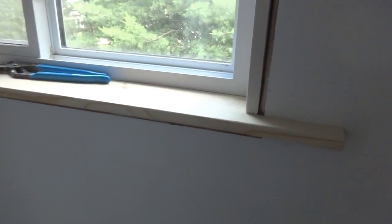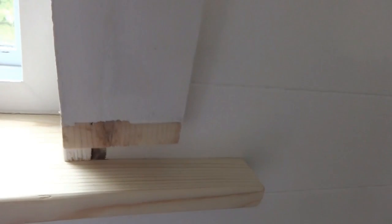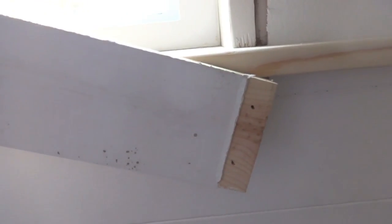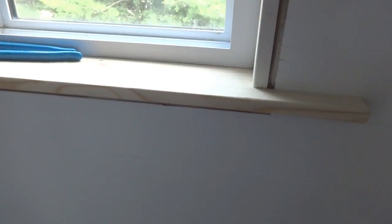Here's a better idea of how I'm doing the window trim. The sill goes all the way back, comes out an inch and a half, and extends to the sides so I can cut another piece to cover the inner board and overhang a little bit. Same thing on the other side. The board up top is wedged in, and then I cut the top piece with that little cut-out. Down at the bottom I have a big one - probably a one-by-six - with the slight angle cut on it. Simple design, just takes some test fitting, but it should look pretty cool.